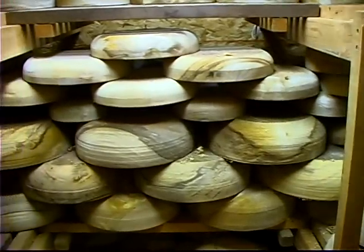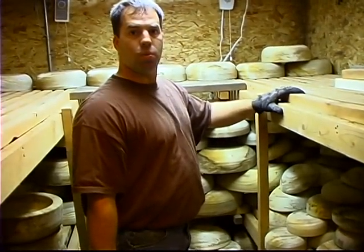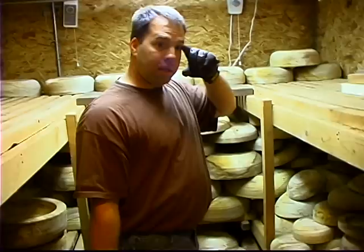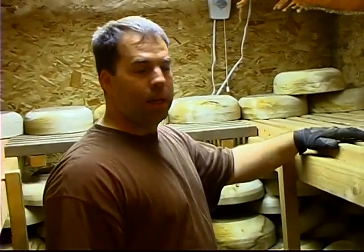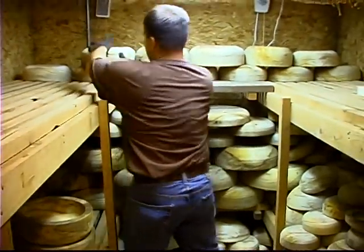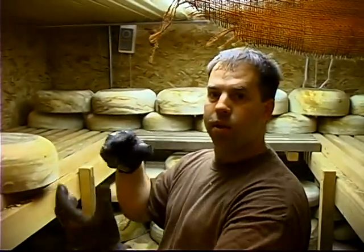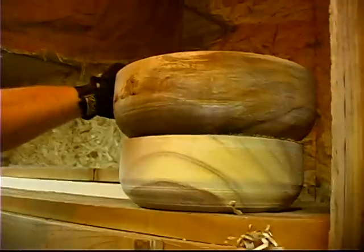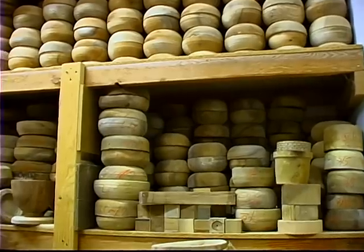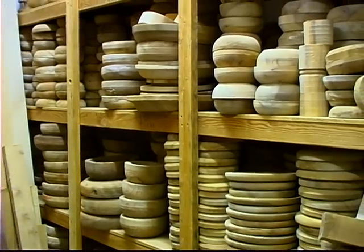What I'm doing right now is getting ready to stack these in our dry kiln. Once we get a full load in here, we'll run the dry kiln with dehumidifier and heat for a period of about six to eight weeks — occasionally up to almost 12 weeks. Each one of those little grain patterns is like a little straw that bundles all the sap and nutrition for the tree. Everything in here has already been dried through the dry kiln; this is a holding room where we maintain temperature and humidity.